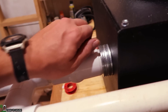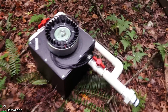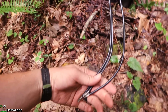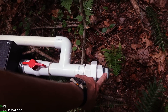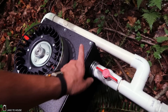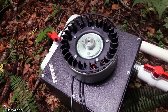Probably half the year this one can stay open if need be. We've just finished hiking the mountain a couple more times to bring the stuff required to install this — a couple of 4x4s to span the creek, and here is the turbine. It is three phase so you have just three wires coming out here, and those are connected up under here so we will be using a rectifier later to get this three phase into DC. The PVC has the input here and it will skirt around here to another ball valve where I can keep that side closed if need be. And this is the 3/16th nozzle here. The motor has a cooling fan on top so it can pull air down into the coils to help keep it from getting overheated.